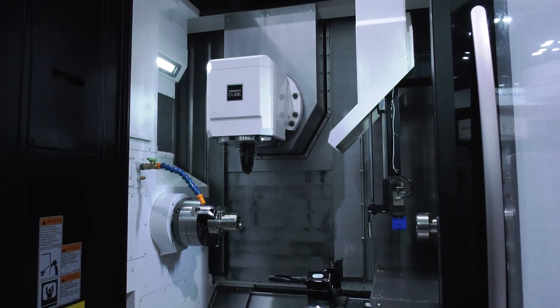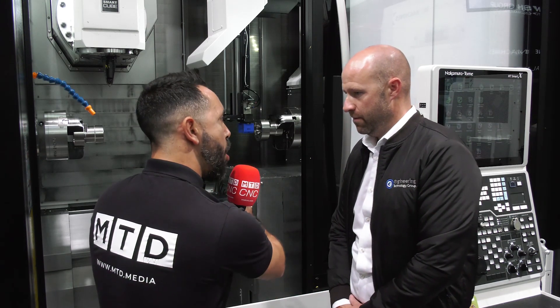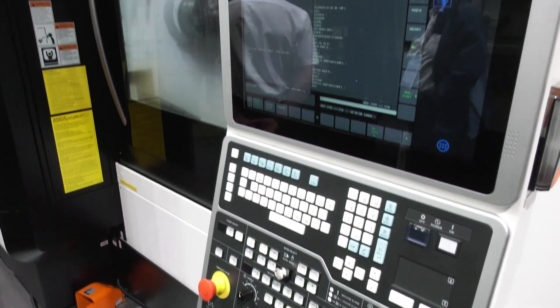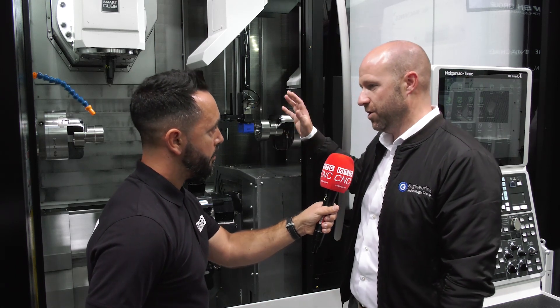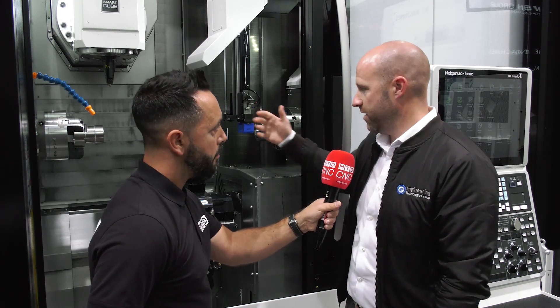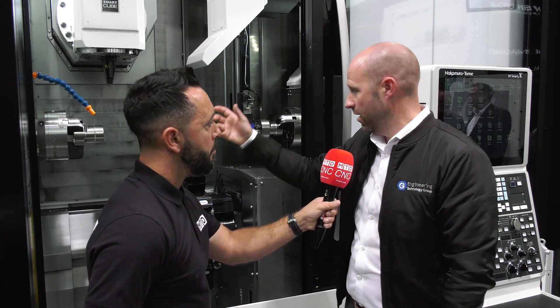You've got the option of adding a lower turret, and that is solely for reducing cycle time. Nakamura pride themselves on this configuration — takt time, customers want to get raw material in and a finished part out within this cell as quickly as possible. When you look at a turning center, you've got the option of bar feed or billet feed. With the JX we have a compact loader configuration where we can automatically load billets within the machine tool itself. This machine is an 80mm bar capacity machine.